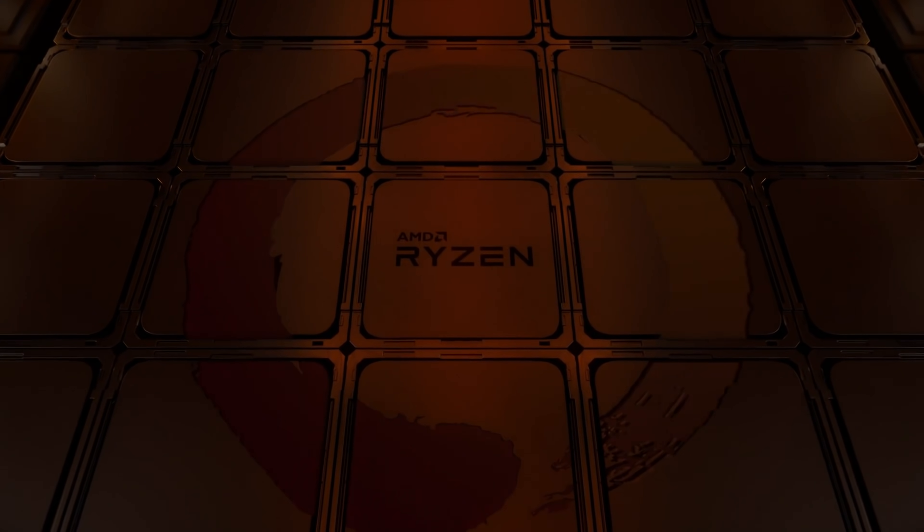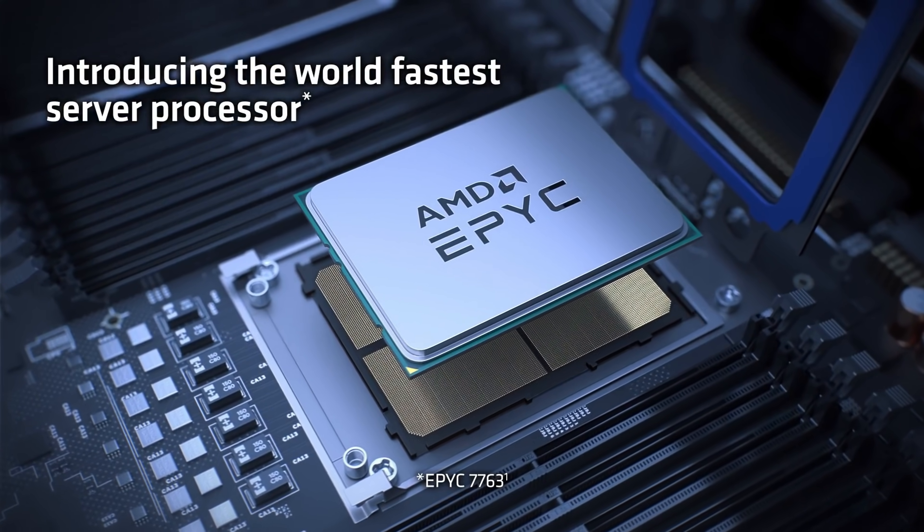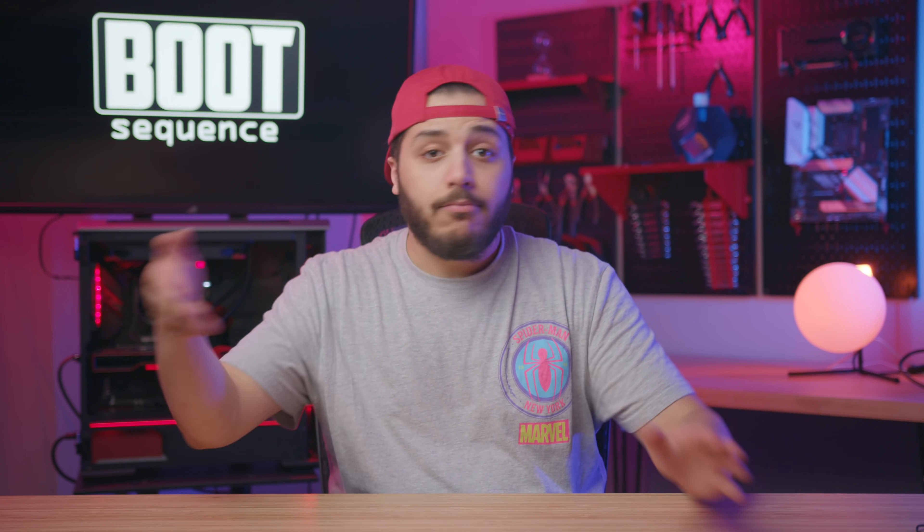Going back to AMD, in the future they want to slice and dice the chip to the smallest extent. Why? Look at Ryzen — by separating the cores and the IO, they got better yields. If they manufactured the whole CPU and the IO was bad, they'd have to scrap the entire chip including the cores. With Zen 2, they built the IO die separately, so if a chiplet was bad on an EPYC processor, replace that chiplet. If an IO die is bad, throw it out and you still have the cores. Now take this philosophy and translate it to smaller and smaller chunks of the CPU. This would also allow them to manufacture these chunks at different process nodes — three nanometers mixed with five nanometers with a hint of seven. Yes, please.